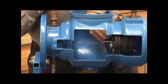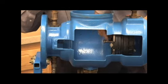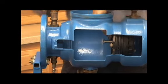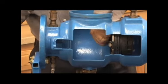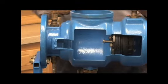Top clip, just like the bottom. Get the first leg in. Compress the spring around. Push it up into the slot. Make sure fully in. Make sure the check's working properly like that, that it's held in there properly.